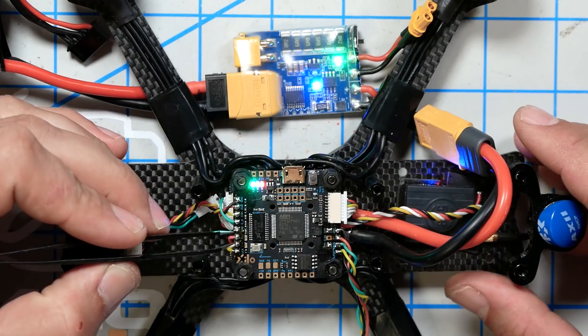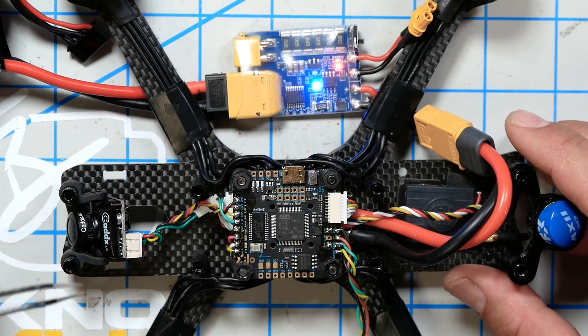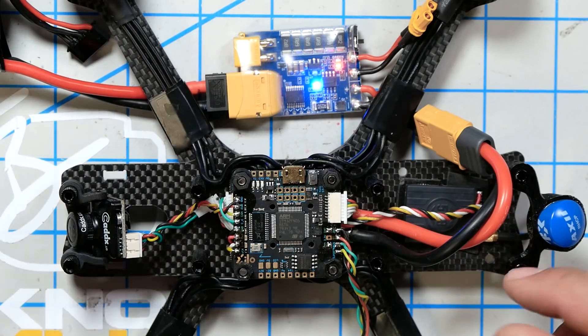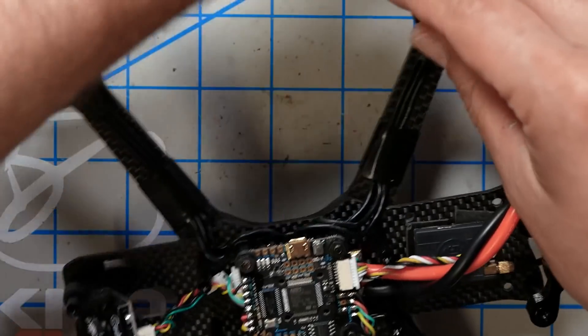I kind of don't want to do it — it feels so wrong. I got a tiny spark, but it has tripped. And notice that now that it's tripped, it didn't just return to the untripped state as soon as I removed the tweezers. Something's not right here. Normally with a smoke stopper bulb, the minute the fault is removed, current is immediately reapplied and more damage can occur. Let's see if anything got toasted. I'm going to need to power cycle this. No harm done — video transmitter's working, everything's working.